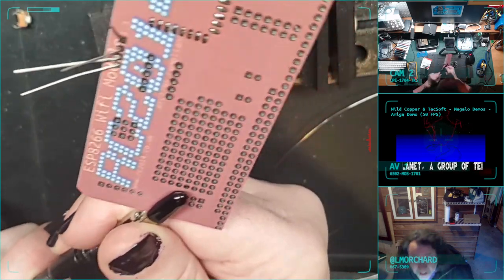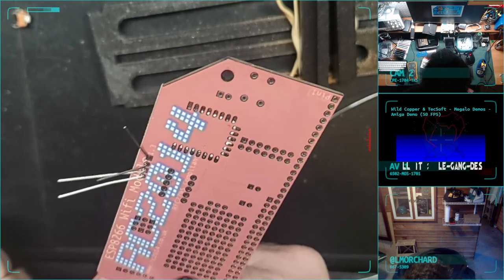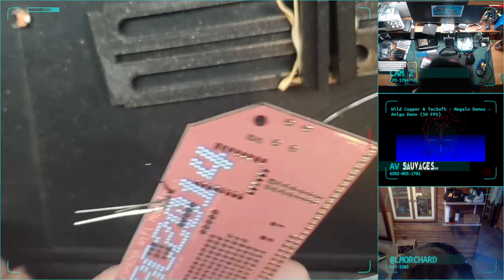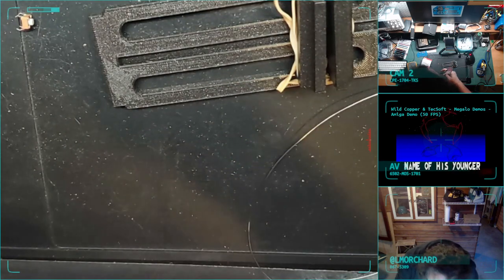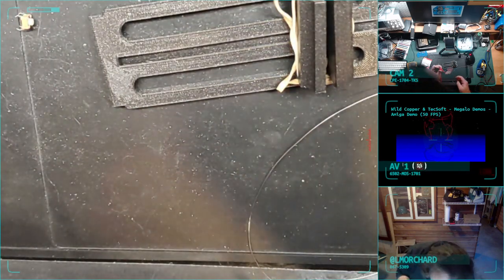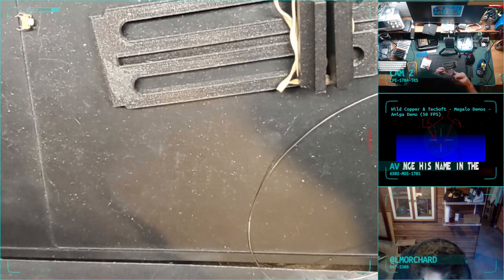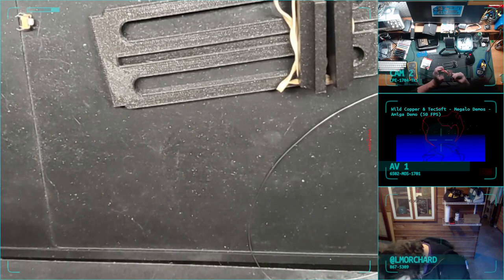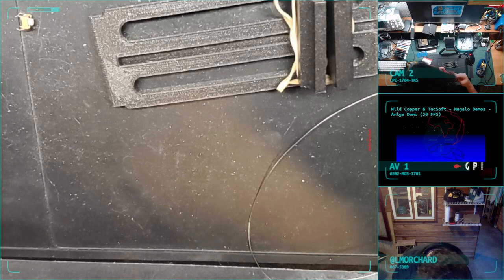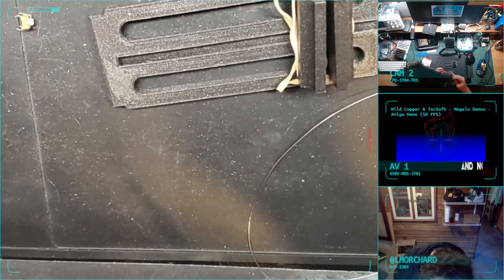But yeah, it does look like I've managed to get solder through all the little holes and castellations, which I think are then virtually the same as pins. It's a weird kind of pseudo surface mount, I guess. And the beeping, I guess, is kind of because my hands are a little shaky when I'm trying to do this. Got any weird shorts?